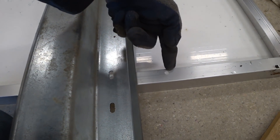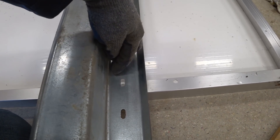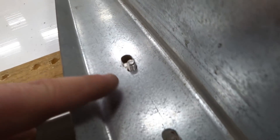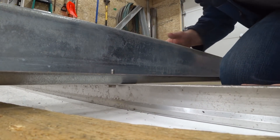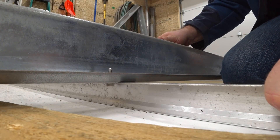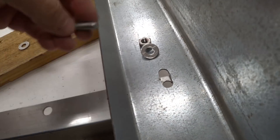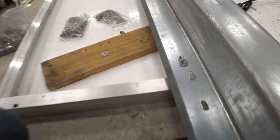On the back side of the solar panel there are two holes for mounting options. This is the inner more one. I'm using some bolts here that are quarter by 20. I've got the Z-channel in with a bolt on each side. There's very little play in these holes, so I'm going to have to be pretty accurate with my placement of this Z-channel.